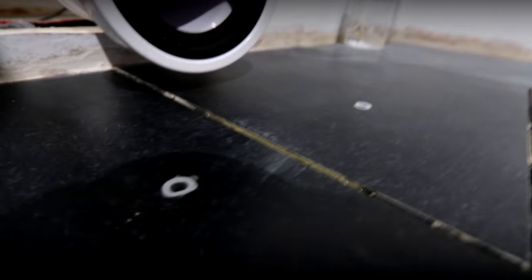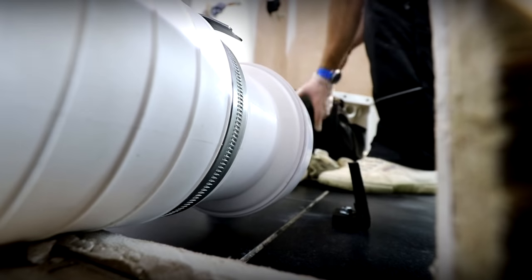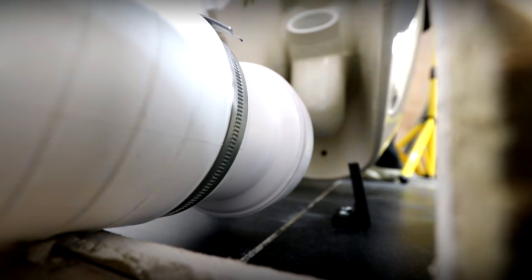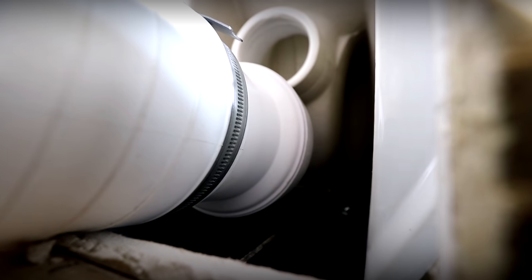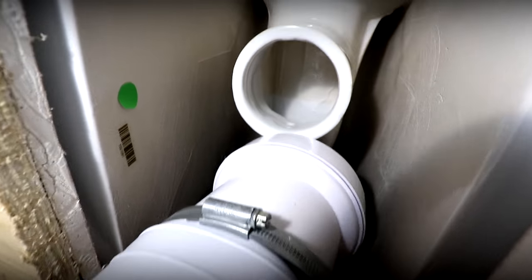Well, that was pretty knackering. It should look a little bit like this, as you can see. Right guys, moment of truth — all that measuring, all that drilling. So hopefully I should be able to push this back up into here. They're both perfect. So we've got both our bits back in there. All it's a matter of now is to find screws and caps and get them screwed on. Leave the caps on until you've done your silicone, because when you put the caps on the toilet they stick out the side, and it can get in the way of your former or your finger as you're smoothing out. So do the caps last.